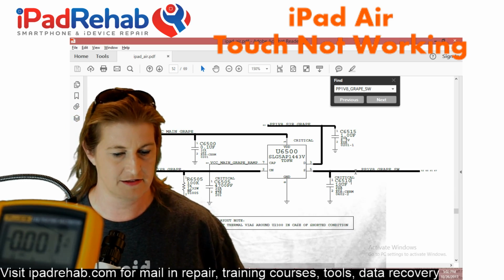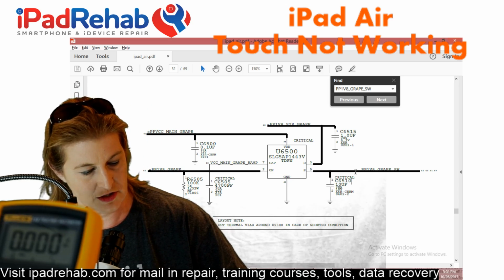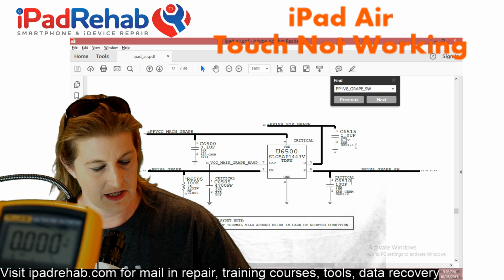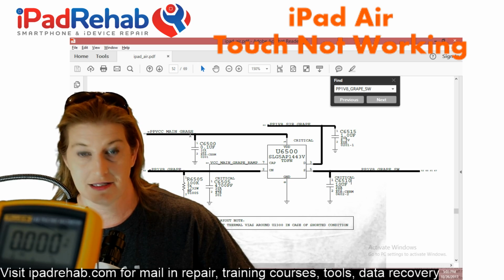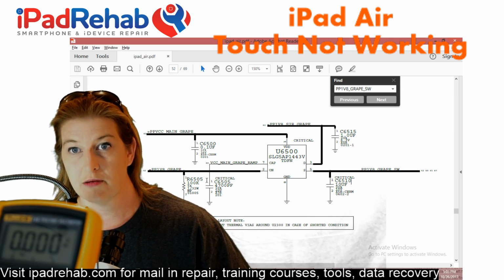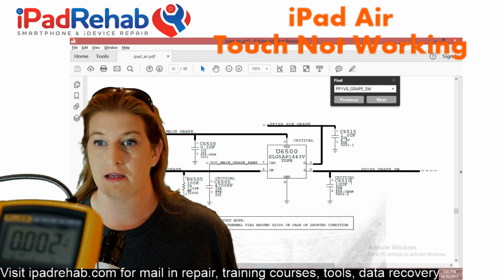In fact, I'm going to make a little list so that I don't forget, because I have a really tough time at the end of the day remembering something like C6515 for more than about 2 seconds. All right, so we want to measure the PP1V8S2R grape. We want to measure that on C6515, and it should be 1V8. And then we want to measure our VCC main grape on C6500. And then we want to measure our PP1V8 grape, which is our on signal. And we're going to measure him on R6505. Okay, so let's go hunt those guys down and measure them.